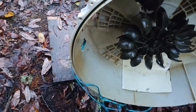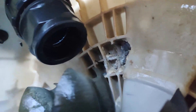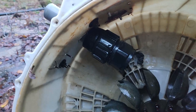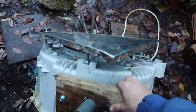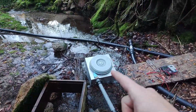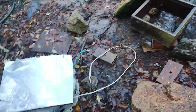The old nozzle is much bigger — it's not even a separate 30 or 40mm nozzle, it's directly using the 40mm PVC pipe going straight in. It's holding the wheel well. The nozzle is much bigger — you can see it's going directly in, around 40mm — and that's producing 380 watts. So I need to increase the nozzle size on the new build, or add a second nozzle, or even four nozzles, and it will produce as much as this one.